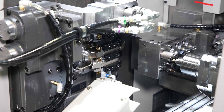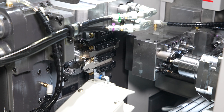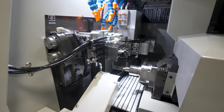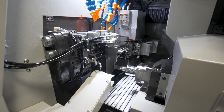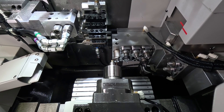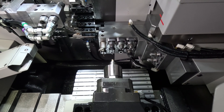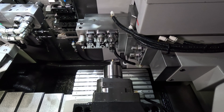I'm going to go over some of the new features of this machine, which are all applicable to its 20mm bigger brother as well. Let's have a look inside. The B0126 and B0206 Mark V machines are 12 and 20mm Swiss-type machines. Historically, these machines have had a simple tool zone, making them easy to use and compact. The new Mark V six-axis version adds exciting new features, including modularity.